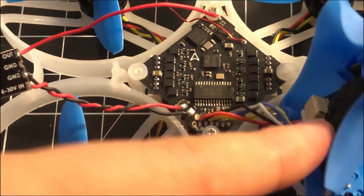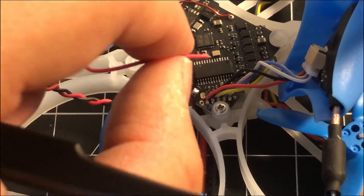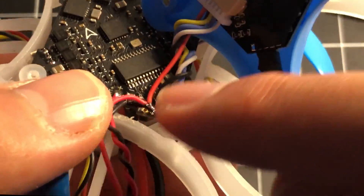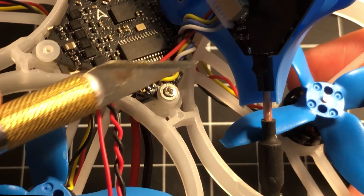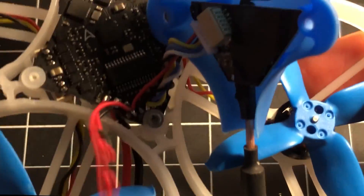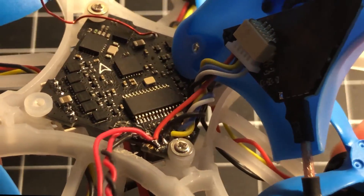This is going to be the trickiest part — I'm going to try to get this wire attached to the five volt pad. It's going to be a little tricky, but I think I can do it. I'm skipping showing the soldering because it was a huge pain and I brought it on myself. What I did was join the video transmitter wire, which requires five volts, and the wire from the BEC supplying five volts to the board — both to the same five volt pad.